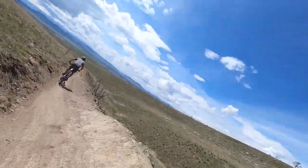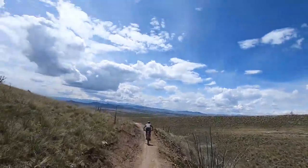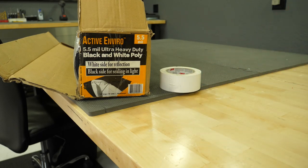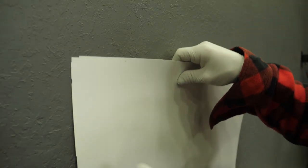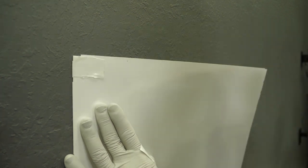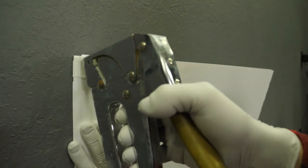That's okay, we're going to get fancy. Alternatively, I could have bought PandaFilm. I did buy PandaFilm. Quick pro tip: when you're installing PandaFilm, grab yourself some white duct tape — you can get that at Lowe's and Home Depot. You staple through the duct tape, and the PandaFilm doesn't rip off the wall, leaving the staple behind in the drywall.